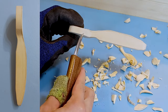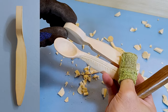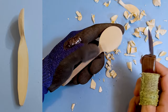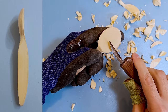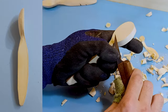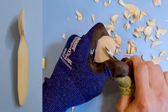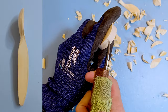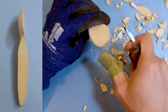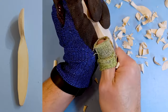So we got the side profile done. Now we need to start rounding the spoon. I like to do this before I start carving on the inside because then I know where to stop, and it prevents me from accidentally taking off too much wood when going inside. Start from this end and work your way back. Since it's a round section, we're going to cut from this part going this direction and from this part going this direction — we're not going to start carving all the way around because if we start going that direction we might hook into the wood grain and remove this entire chunk. Just start from the top and round it up to about an eighth of an inch from the top. Since we're cutting across the wood grain, smaller cuts are your friend here.